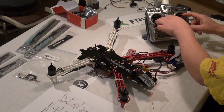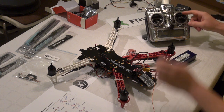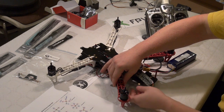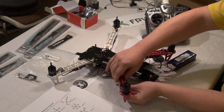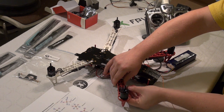Number 3 is supposed to be anticlockwise but it is clockwise. So what I simply do is change two of the connectors on the ESC controller.